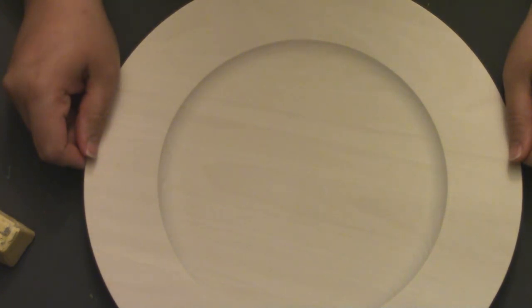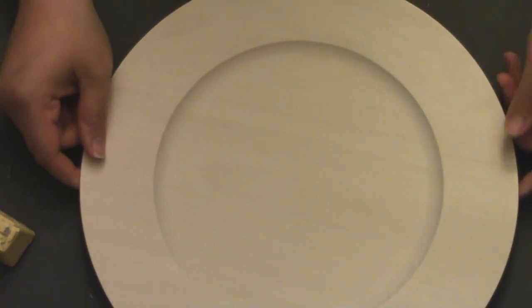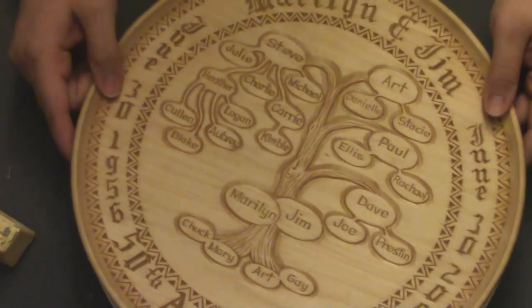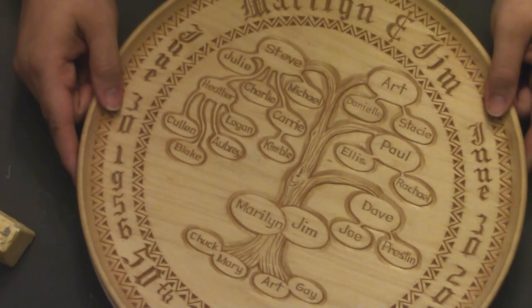You want a wood with a firm and tight straight grain, is fairly common and inexpensive, and is easily carved with a knife. Most carvers favor basswood because it has all of these qualities. Basswood is a hardwood and very easy to carve. And its color will range from a pale cream, as shown here, to a yellowish brown. Oiling your project when you're finished helps highlight the shadowing of the chips and enriches the natural color of the wood. The texture of the wood is uniform, which is ideal because the grain won't compete with the overall design of your carving and will increase visual appeal.